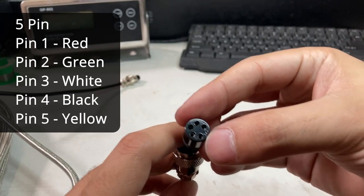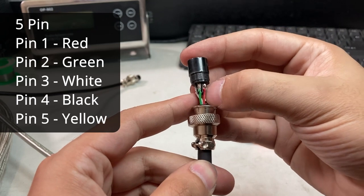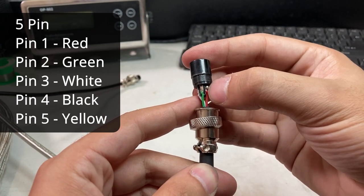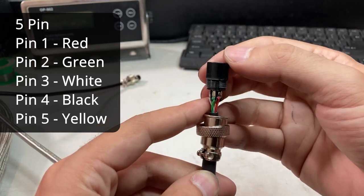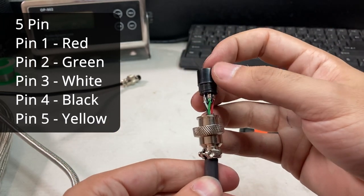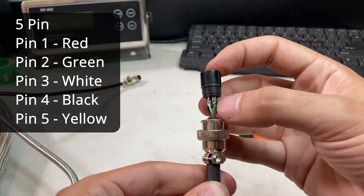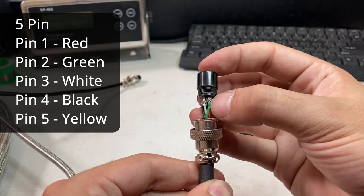You'll notice pin 1 is the red cable — you can see this one is not broken off. If you notice one of your colors is broken from solder, this could be a reason for getting no signal to your indicator when you put weight on it and take weight off and it still reads zero. Pin 2, labeled as 2, is the green cable — it's good.